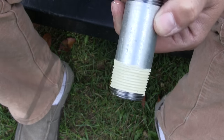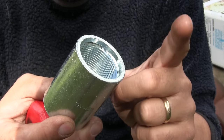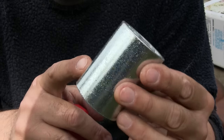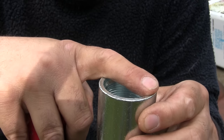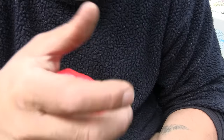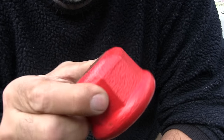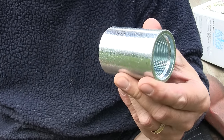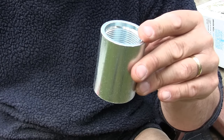If you're going to use a homemade well driver, you're going to ruin one of these drive couplings. Take the drive coupling that's going to get ruined — that's the one you're always beating on. When you put on an extra piece of pipe, take that coupling off, put on a fresh coupling with your extra piece of pipe, then put the beat-up one back on top where you're actually pounding. If you're using a drive cap and a sledgehammer you don't have to worry about that. If you're using a homemade well driver and beating on the coupling itself, you'll need one extra.